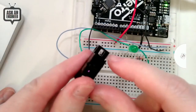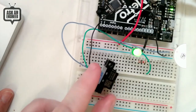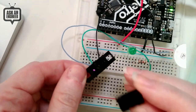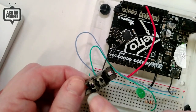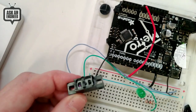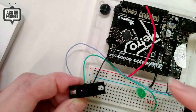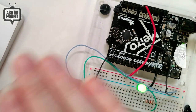Let's show this off. I opened this one up — normally it has a very nice sealed cover. You can actually see the transmission diode here, and then there's the receiving diode, and a little bridge in between. These are tuned to not interfere with each other. When I put my hand in front, you can see this indicator LED — which I've wired to the output — turns on. So it's really simple.